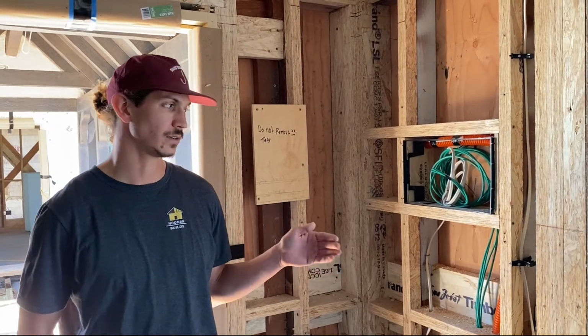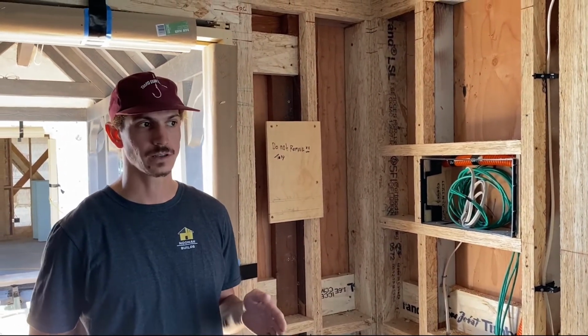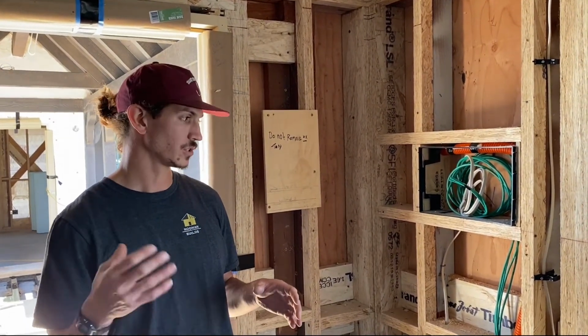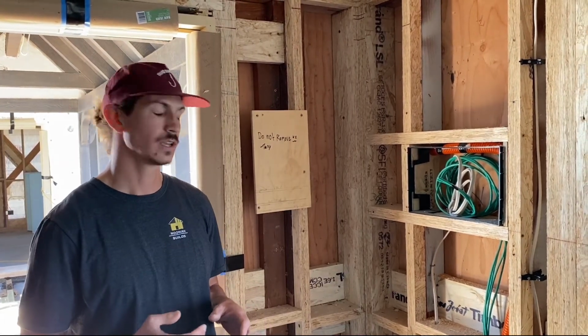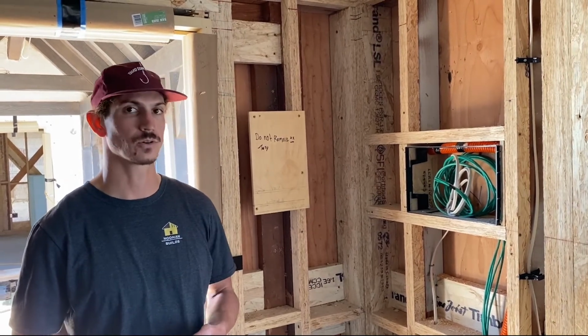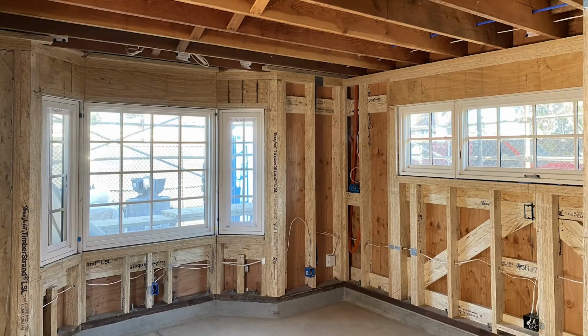And when you bring in new lumber and old lumber, if we were to have used green lumber, the moisture from the new lumber would suck into the old lumber and it could crack and split, especially after putting nails through it. So the engineered lumber is perfectly dry and matches the moisture content of the old lumber. So we replaced every stud in the house where we didn't do the rip and sister technique.